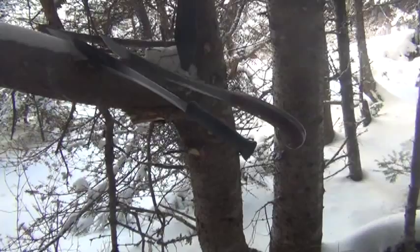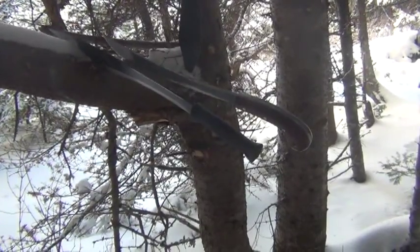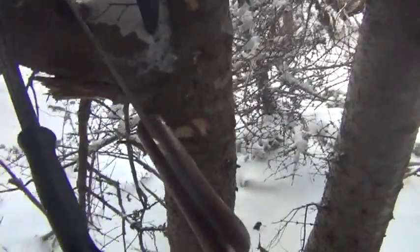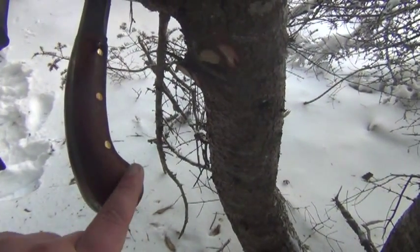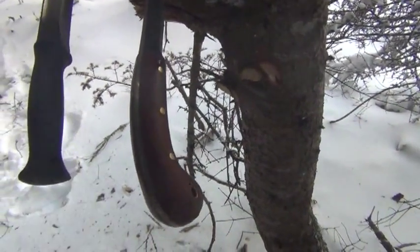The reason that traditional blades don't have breakages that commonly is because they drill out, bore out, or burn out the handles, and they use split rings on top to hold the wood together — they don't do construction like this. The other thing they do is when you're selecting wood, you have to very carefully get the grain of the wood to follow the grain of the handle and wrap around at the end of the bottom. So ideally you'd want to use something like a burl, root, or end-grain wood for this, and not just a piece of relatively straight-grain wood.